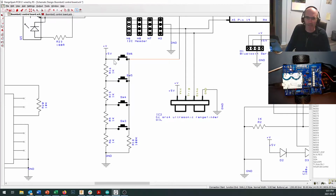Now, if I don't push that pin and it comes down right through here, then I've dropped off by 1/4 of the total voltage, or about 1/4 of my 0 to 1023 range. So I'm going to be reading somewhere in the 750 range if I put the next button down. And then if I don't push those two buttons, then the voltage needs to come all the way down here. It's going to be now halfway between 5 volts and 0 volts. So I'm going to have about 2.5 volts coming out here, or somewhere around 512 is going to come back here and be read on A2. And finally down here, I'm going to be around 240, 250 somewhere when it comes back and reads all this.